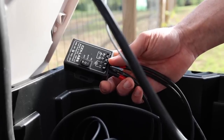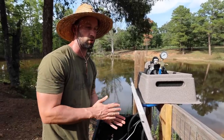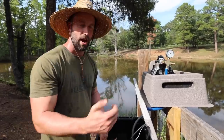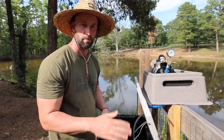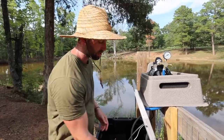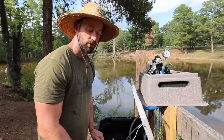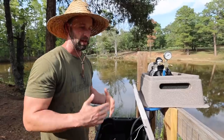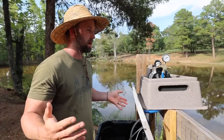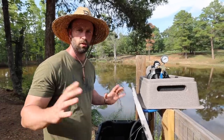With this low voltage disconnect, I can prevent the voltage dropping so low that it causes my inverter to trigger and set an alarm. I would have to manually come out here and reset the inverter if the voltage ever dropped low, so my way of mitigating that is this low voltage disconnect. I also have a timer, so it runs roughly 10 hours a day during the peak of the day. I think I have it set from 9 or 10 till 8, roughly somewhere in there.